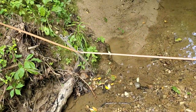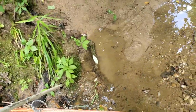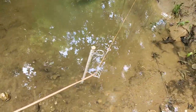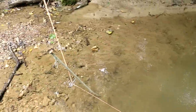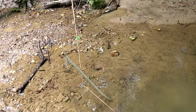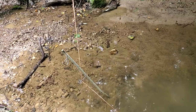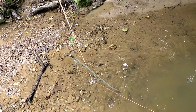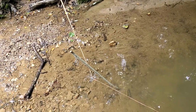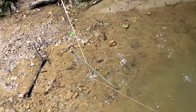So we've got the wire across the creek. There's a post there and one right in the middle of the creek — notice the posts are driven at an angle so when brush comes down through there it can take that tape out. When we leave the farm we just roll the tape up and set it up on the hill where the rain and flood can't get it. The floods will not take those posts out — they're in the ground about six feet.